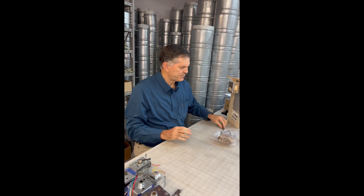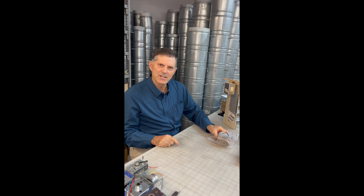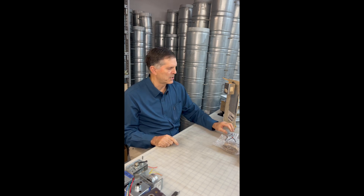Before you get into doing this, make sure you have a low voltage system. Almost any damper system that has some sort of zone control panel like this and uses small wires are almost universally 24 volts AC. However, there could be some 110 volt motors out there. If you see black, white, and green wires, just be aware of that and do whatever you need to do to ensure your own safety if you are unsure.